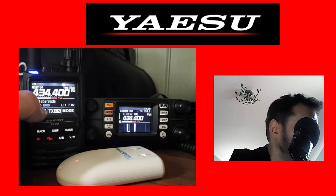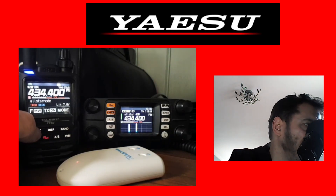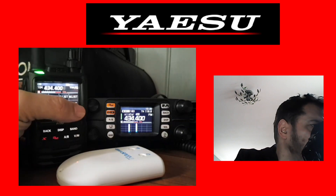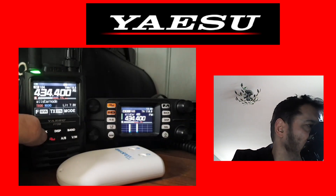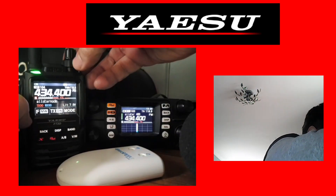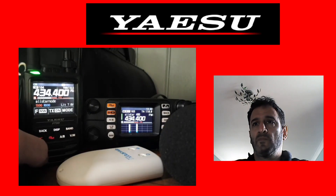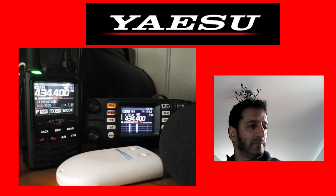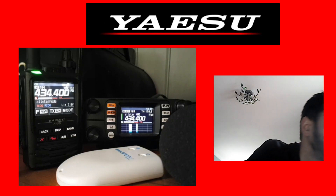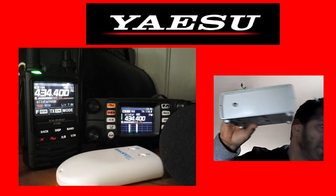I don't know why I can't get into scope — I've done it many times. It must be something I've got turned on that's stopping it. Anyway, it does work and is very similar to the FT300's scope. I managed to fit the Baofeng with the CM108 sound card glued to the underside of the Baofeng because I was tight for space, then brought all the wires around. That's the AllStar node — a standard USB cable with the square connector on one end and the flat one on the other, and the node is in that little box.